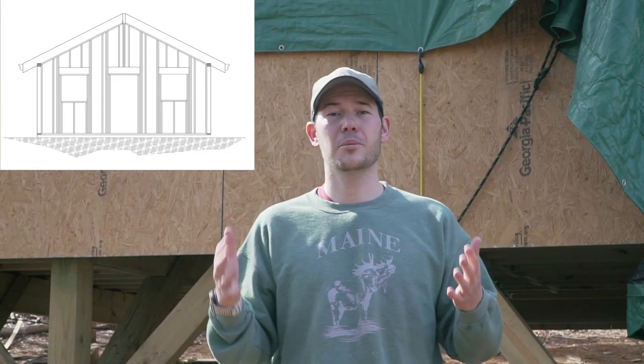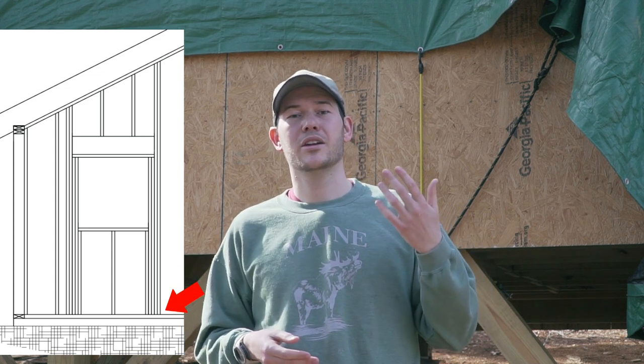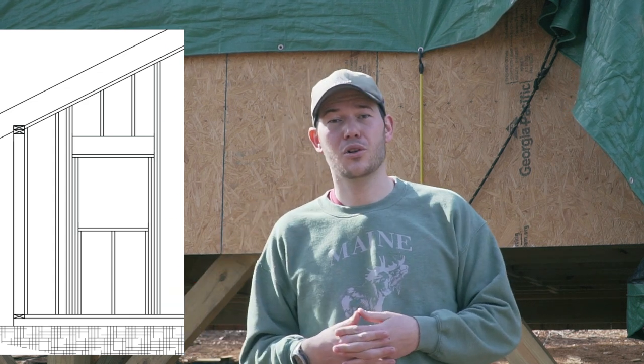Now is the time to build the front gable wall — it's going to be 20 feet long, about 13 feet tall at its peak. Because my cabin will have a vaulted ceiling, you need to balloon frame this wall. Balloon framing is when we make the stud continuous from top to bottom so that we can transfer the wind loads back to the floor and the roof.